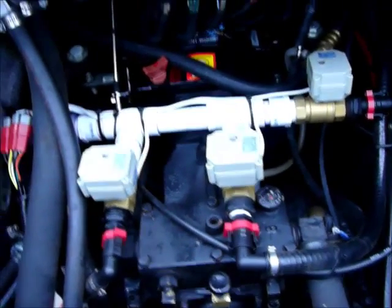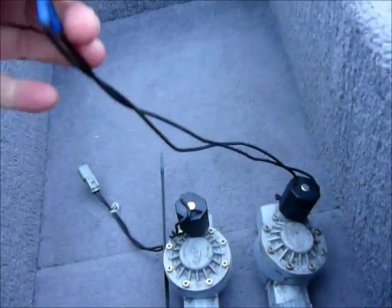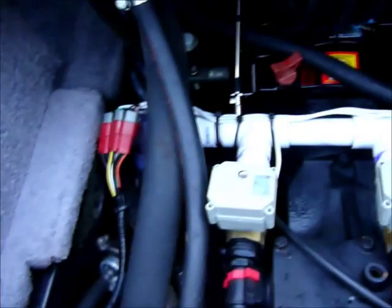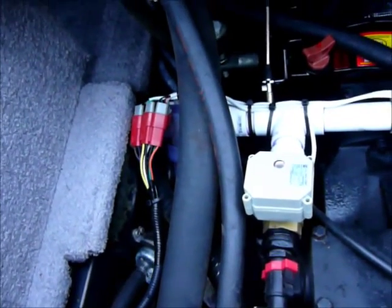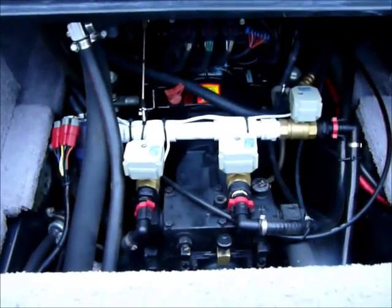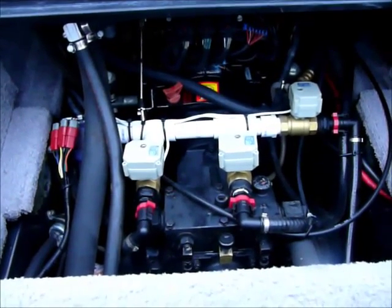The other component here is that the original system had a two-wire on/off — the solenoid was either on or it was off. These mechanical ball valves have a three-wire scenario, so I had to build a bit of a circuit board to adapt that over so I can maintain my same switches in the boat. If you guys are interested in understanding what that circuit is, I can forward it to you — just give me an email.